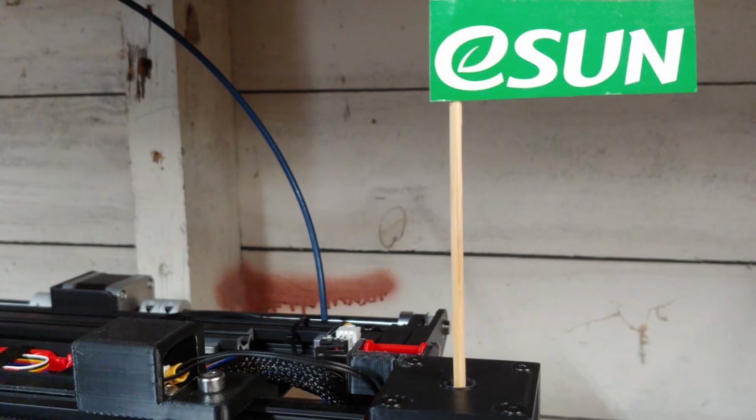So this is your access cover. About 10 little skateboard bearings for like $5 or $6. Just go on Amazon, look up skateboard bearings. So here is the cover, pretty self-explanatory. When you print these, the holes tend to gum up right here on the end. So make sure you ream these out with a screw if you have any kind of fit problems.